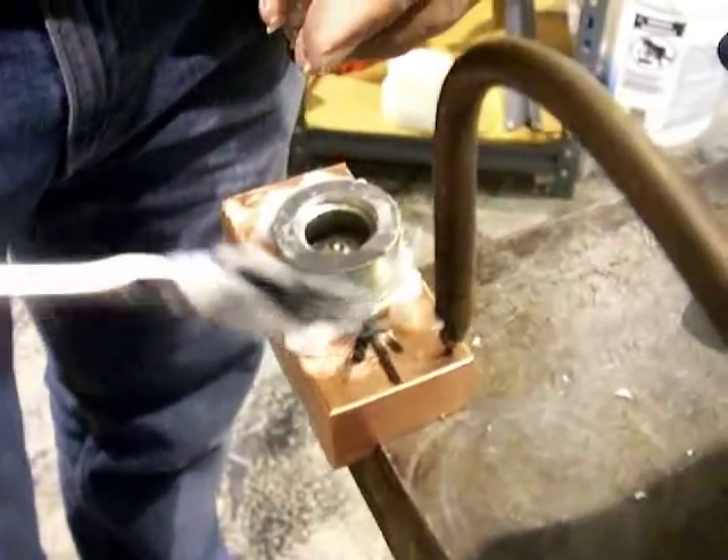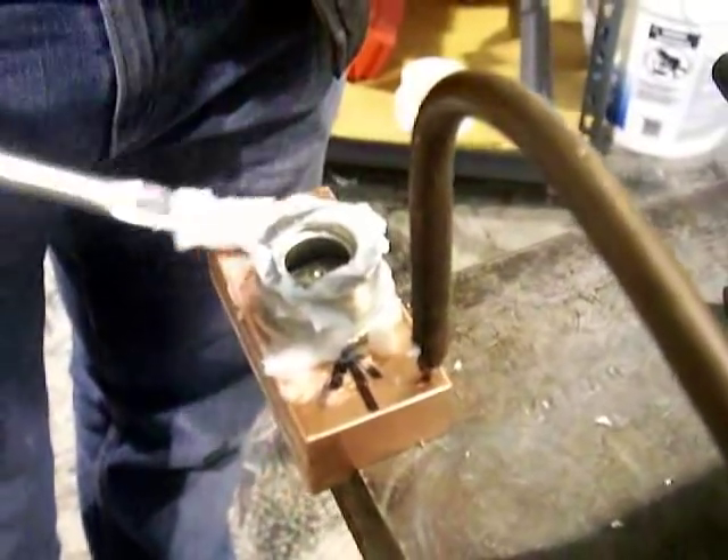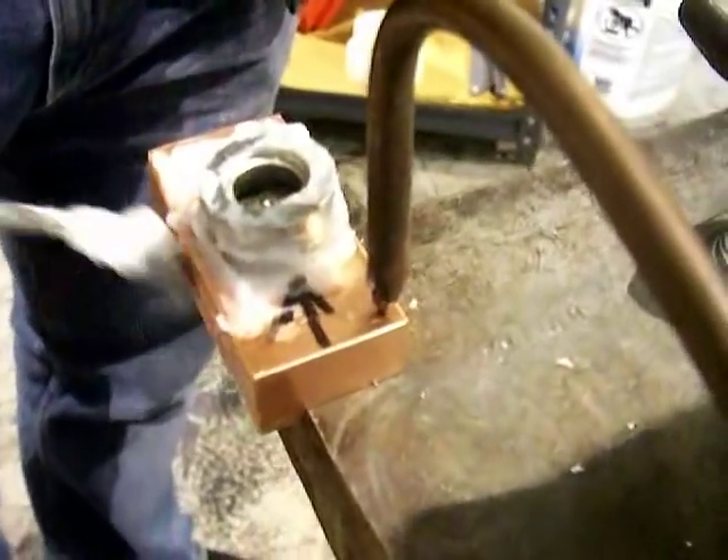So get this all in place again with the pre-placed ring. I didn't get this one that close, but that's going to be plenty of filler metal to do the job. A little extra flux on the filler metal and all around where I don't want it to scale — I want to protect it and keep that carbon steel from scaling.